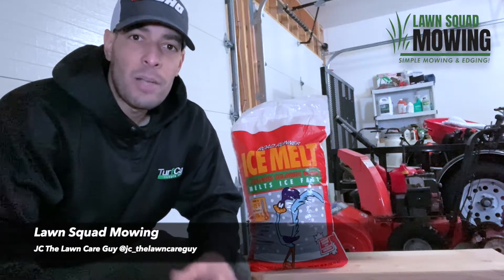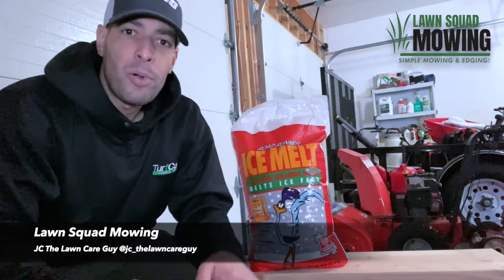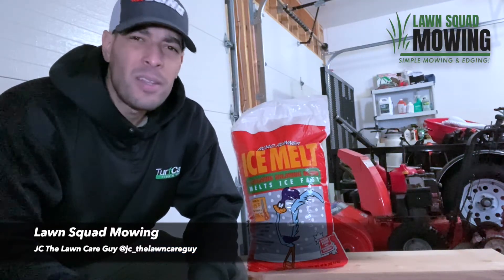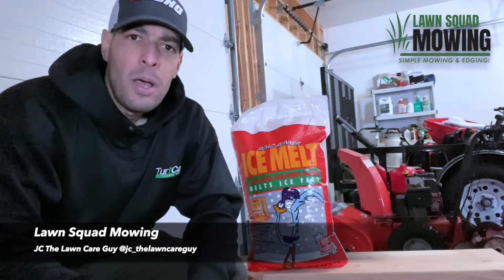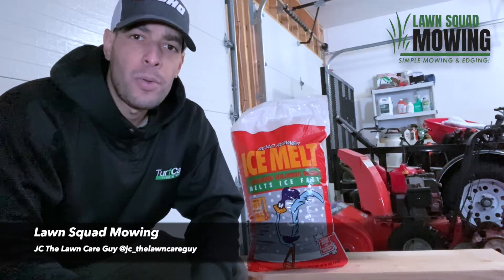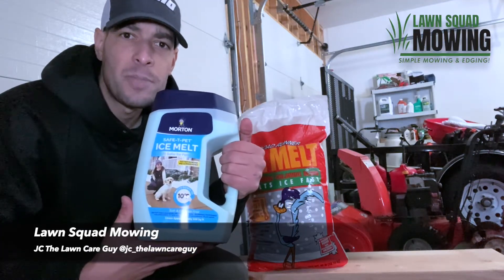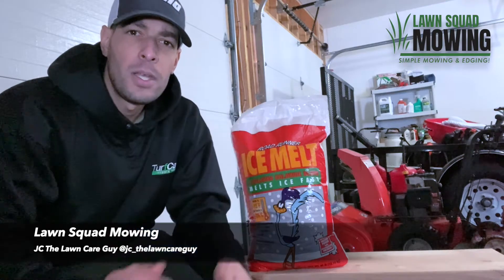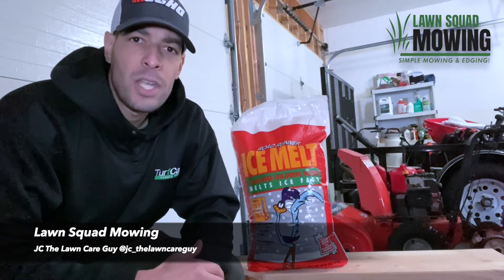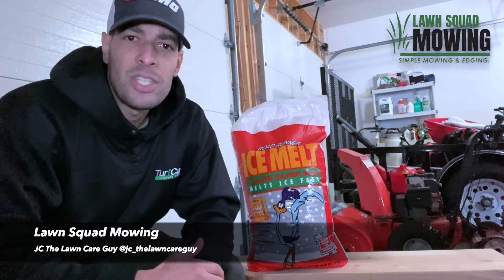Next, let's talk about urea, typically marketed as pet safe and environmentally friendly. The pros are that it's not too damaging to concrete and asphalt — probably the least damaging out there — but far less effective as an ice melt since it only works best at about 25 to 30 degrees. Most urea ice melts claim to work down to 10 degrees but are still not very effective. Over-application of urea, or any ice melt, can damage vegetation and lawns, but proper application is key.